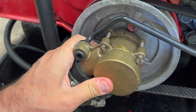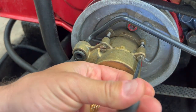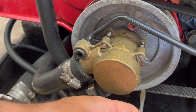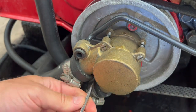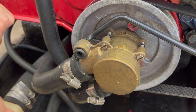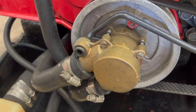Just jig it around and screw it all the way in. As you can see, it's pretty easy to replace this impeller. I hope this video helped you on how to replace the impeller on your boat. If you haven't subscribed, please consider it — I'll be doing a lot of regular maintenance on this engine and boat, so hopefully this can help anyone looking for information. Thank you for watching, see you on the next video!